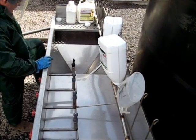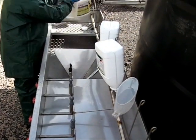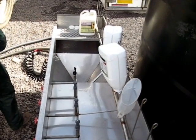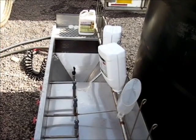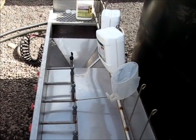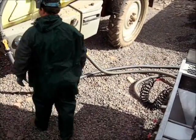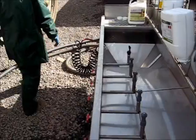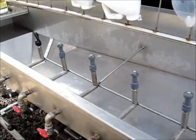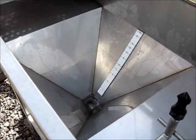At this point the sprayer has around 1700 litres of mix in it. The remaining 1500 litres could be added by the ProFill in just 7 minutes. If the operator wishes to speed up this time, some users will use their own sprayer suction pump while others will opt to use a secondary optional pump on the ProFill system. Filling in this way can raise the fill rate from 200 litres a minute to 700 or 800 litres a minute.